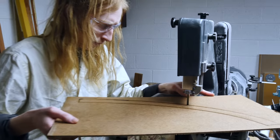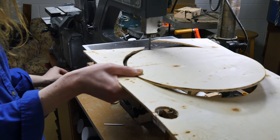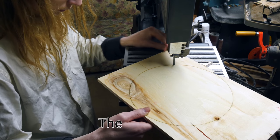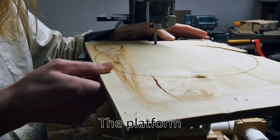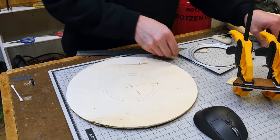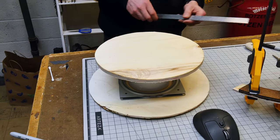We're building a few things. This is the arm that's going to support the camera — I'm gluing a couple of pieces together because it needs to be a little bit stronger. I use a little bit of MDF masonite, and this is one of the turntables. This looks like the base that goes at the very bottom, where the lazy susan gets mounted, and then we're going to cut out another one — this is the little base where the object is going to rest on top of. I'm doing a little old school work to find the middle using a compass, lay out where that lazy susan is going to be, and I've got a rough idea of where the center is. I'm going to raise that platform up so everything else will rotate all around it.